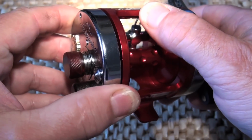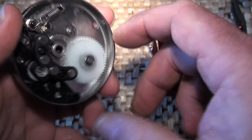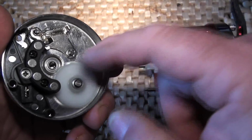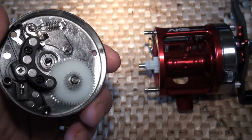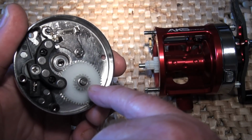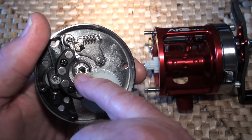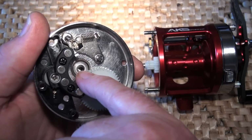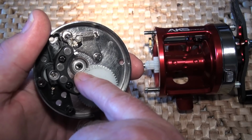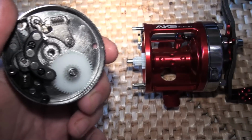And off she comes. And inside here, oh look, hang on, need to push that back in, there we go, two bearings in there, so we're on 13. Oh look, these bearings here, by the way, are ABEC 5 stainless steels, and this one here is also an ABEC 9 hybrid ceramic run dry. So 14 bearings, but no, there's 15 in this, and I'm not going to tell you that the other one might be on the shaft on the end of here.